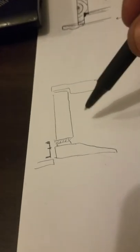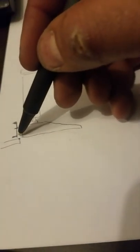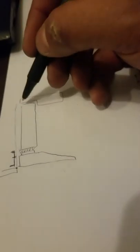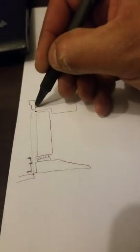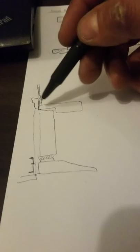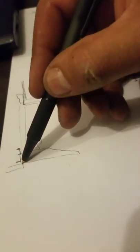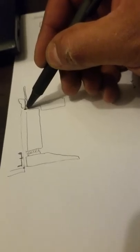In this case we follow the same practice: put your tape measure on your floor — hardwood, carpet, whatever — and measure up to the bottom of the head jamb. Your trim on the inside would be here, that's the drywall, this is a cross-section side view. Your casing sits back from the edge of that piece of wood by sometimes an eighth or a quarter of an inch. So from the floor to the bottom of that head jamb pocket you're going to get some number.